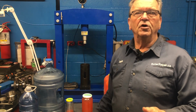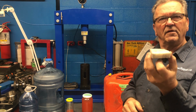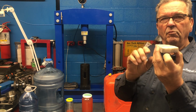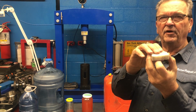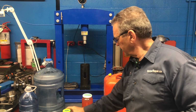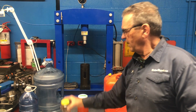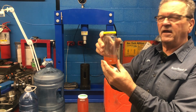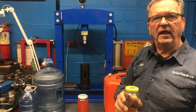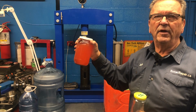So this really shows what I always use my analogy of: we have a sponge, and the sponge will be the ethanol. We can add water to the sponge, or to that quantity of ethanol, and it will absorb it and hold it. But then it reaches the point, just like a sponge, when there's extra water applied to it, that it will drip off. This is how much extra water there was. So we have our completely saturated ethanol right here, and extra water that it would not hold. This is why I say, if you have even 1 drop of water in your fuel sample, when you check your fuel tank, sump your tank, then this is what the rest of the fuel is like. It's already completely saturated.